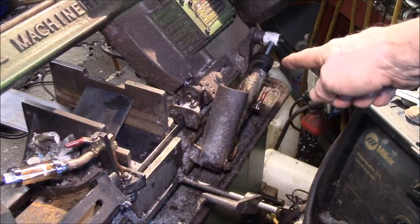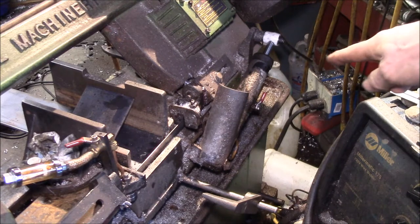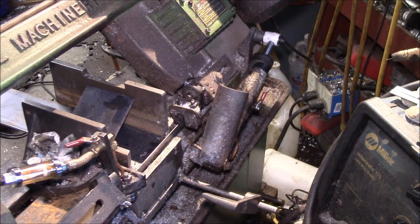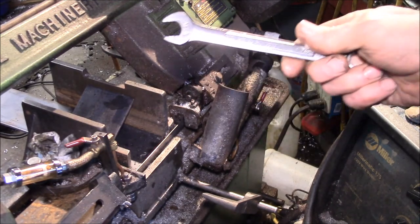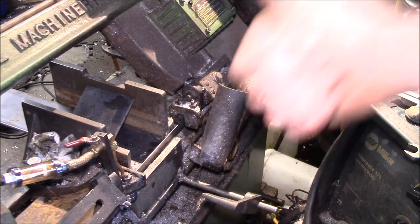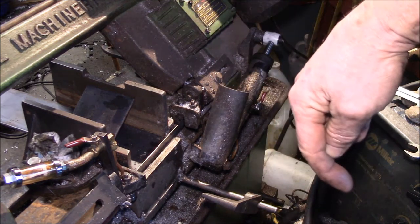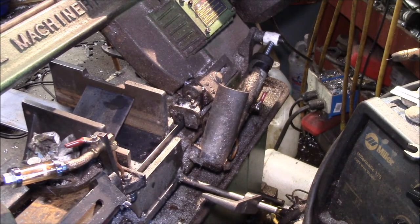I just couldn't figure out how to bleed the air out because there's no separate bleed valve, but the trick is you just crack the valve open a couple of turns — not completely open, just enough to let the air and any excess oil come out. Once you're done, get your wrench and snug it back up. It's a 14 millimeter wrench — all the fittings are 14 millimeter or 9/16, so you just need one wrench and a little squirt bottle of hydraulic oil to get your downfeed cylinder working again. Hope you enjoyed that repair — give it a thumbs up, share it, and thanks for watching!